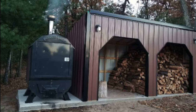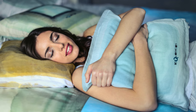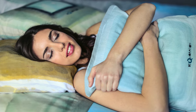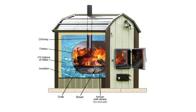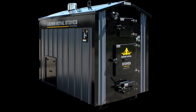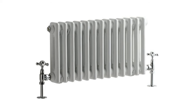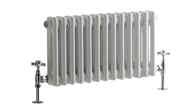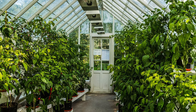Wood boilers work about 100 feet away from your greenhouse outside and have a large burning chamber for enormous BTU outputs. The best part is they can burn throughout the night because they operate on a thermostat that controls airflow to the fire. By controlling the oxygen the fire gets, you can extend the fire for longer periods of time. Expect to refuel a wood boiler about twice a day, but if you feed it before bedtime, you can usually get a good eight hours of sleep even in the coldest temperatures, especially if you feed it hardwoods. Some of the new gasifier wood boilers are so efficient they only require one feeding a day. Besides letting you sleep through the night, a wood boiler provides even, stable heat through water radiators and radiant heat floors on thermostats. Plants love stability, and wood boilers tend to be the heating method of choice for small commercial operations.